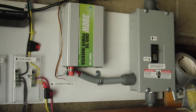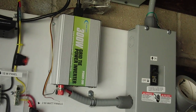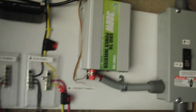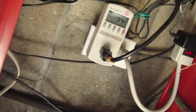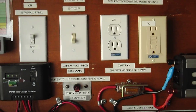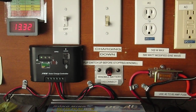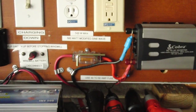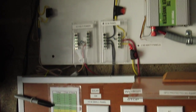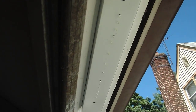I disconnected the cooling fan today because it's pretty cool outside, and disconnecting that external fan gives me about 2 watts more in power. So right now I have about 94 watts into the grid tie, which is about what you'd expect — with these inexpensive grid tie inverters you get about half of what you put in. Otherwise the system works very well; I have backup power and use it to power my LED lights, which are working great with no problems.